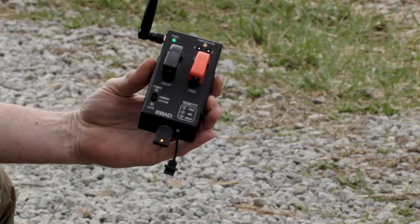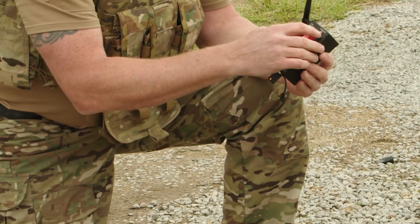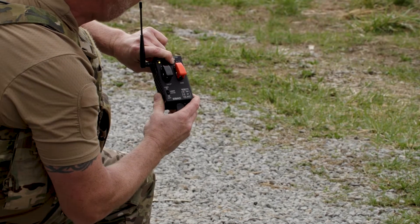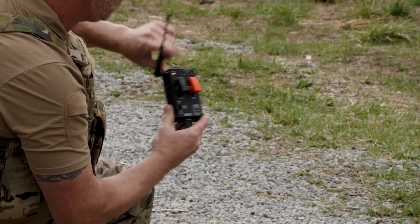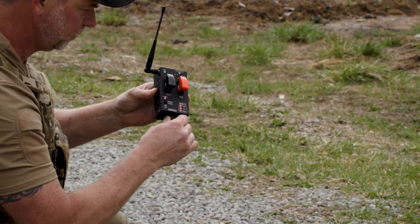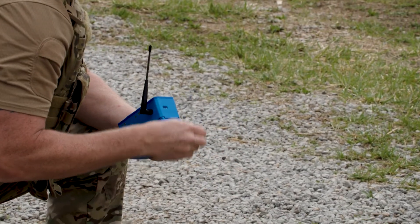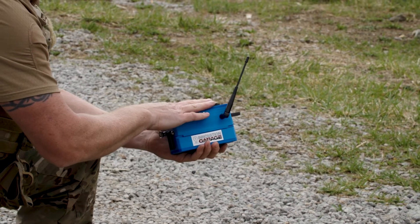Power on the remote. If this USB has already been paired to another device, you can un-pair it by pushing the button. We are now going to push the P button for pairing — hold it in until you get a fast blinking light. Release and push again. The light disappears, and you have now paired the USB to the actual remote. You can now remove it and insert it back into your control module. This allows this remote to only talk to this control module.